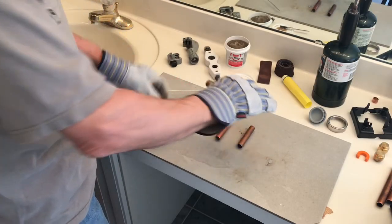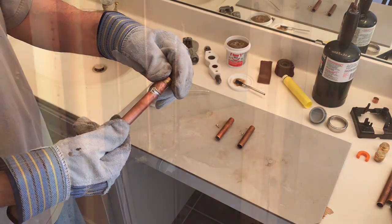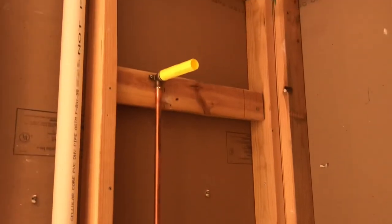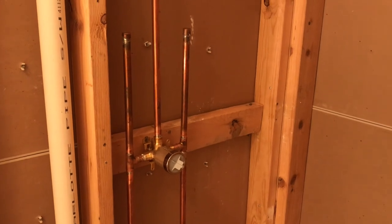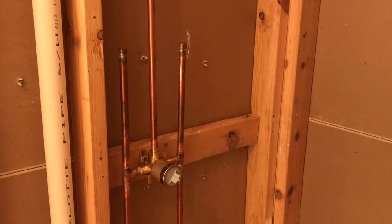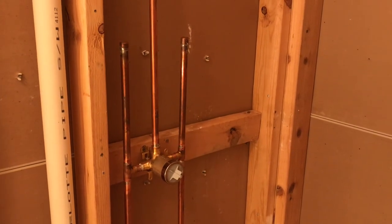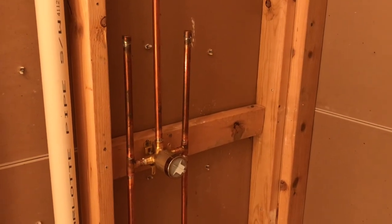In the end, this is what you're after — a nice solid bead all the way around the joint. Here's the completed valve assembly all soldered in place. I got the test cap back on the valve assembly and the test plug at the shower head, turned the water back on, and we had no leaks. When we get to the tiling stage we'll get that plaster guard back on and show you the trim package at that point. Don't forget to hit the like button and subscribe — next video we'll be working on the solid surface drain, moving it from the old location to the new location in the front. See you next time.